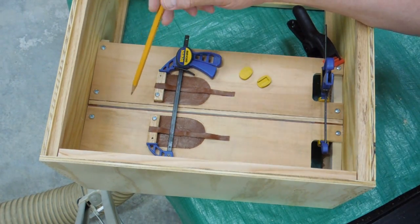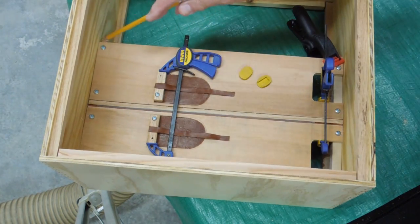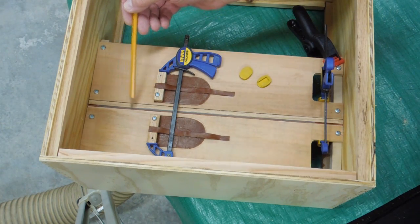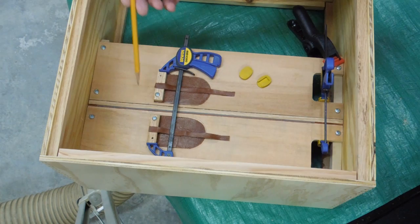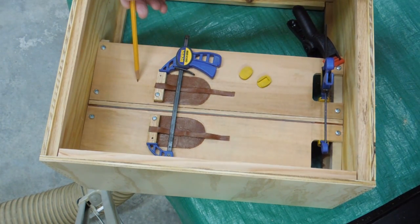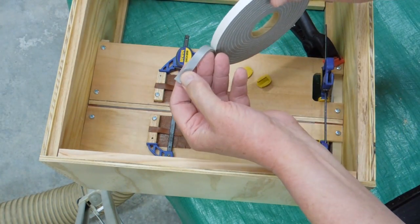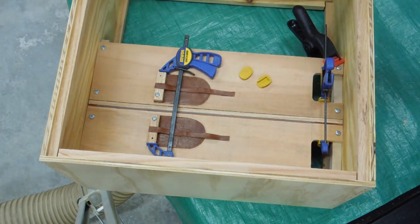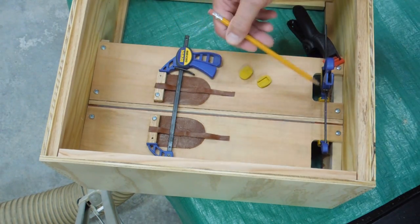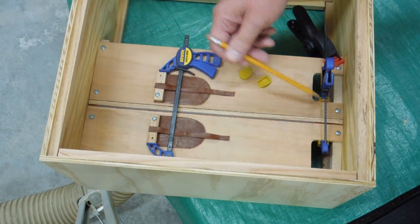I'm in the process of installing the two bellows in this box. This bellows was attached to these plywood strips. The edge was shimmed out to the same level with strips of leather as the leather for the bellows. This strip of wood was glued to this bellows and sealed along that edge, and a piece of foam window door sealing tape was placed on this strip of wood. Then I used these clamps to compress that seal and then installed these four screws.